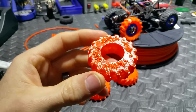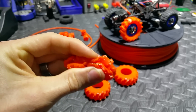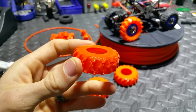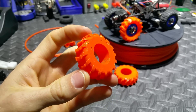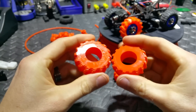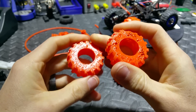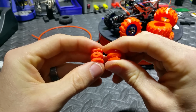Taking a look at these tires more closely, you can see the top layer is not perfect, but it is perfectly squishy. If we flip it around, the bottom layer is perfect. When I mount them to the mini rock crawler I make sure to put this side facing out. I learned that if you print with more top layers to help close all the holes, the tire becomes more rigid. By changing just a few parameters — infill, shells, and top and bottom thicknesses — you can get different results depending on what you want.